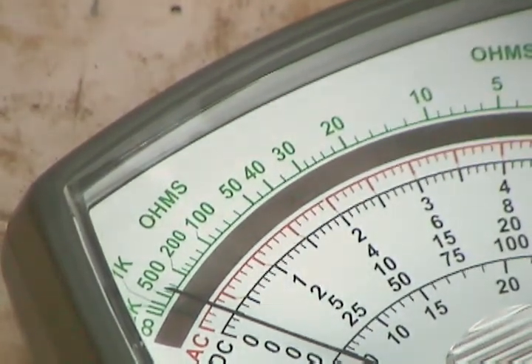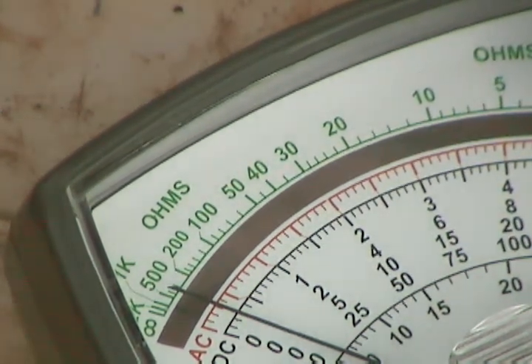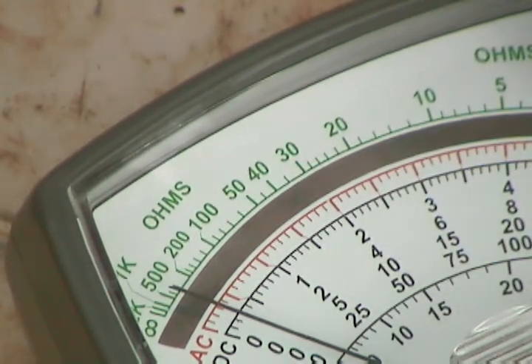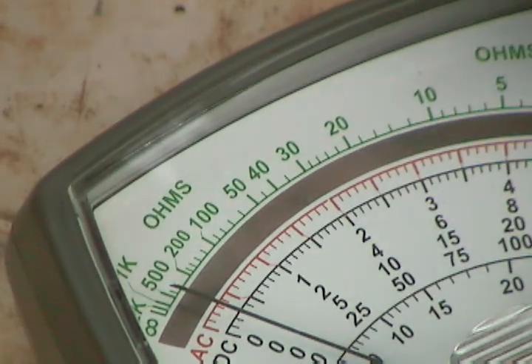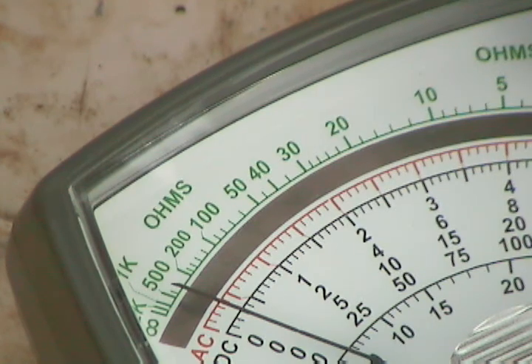Do we have good ground? If we don't have good ground we have nothing. Yeah it's at 0.2. Okay, well here's a simple test — we'll just disconnect it from the meter for a second. It goes down. Connect it back up — it goes back up. So it's got some voltage. It's going up to two and a half.